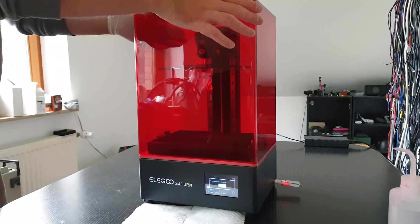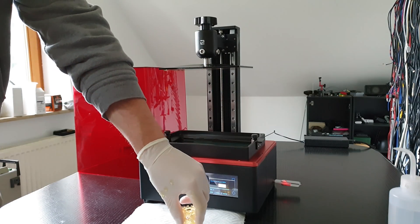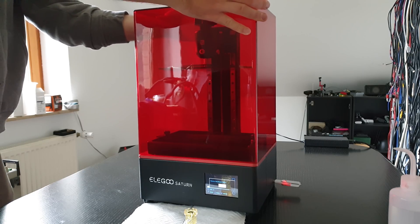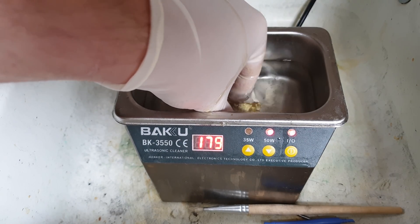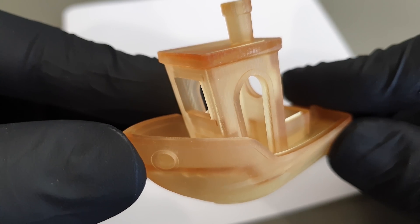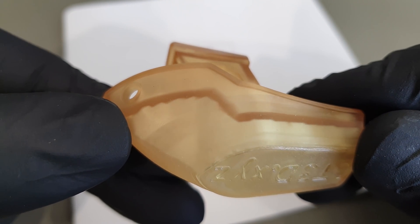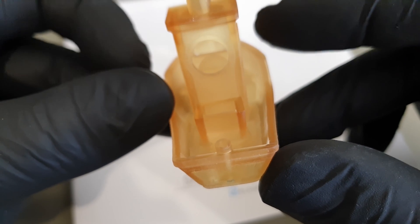Let's see what the new printer has been up to. As always, the resin printing process depends on many parameters being correct, and a change in hardware, resin, or even model can require adjustments everywhere. Since I only just received the new 4K model three days before the release date of this video, I don't think I've dialed in my process perfectly yet. But I can already say that the results on small parts are above and beyond. What benefits the most from the high resolution are round natural shapes — they end up with an almost ground-glassware kind of look. Flat geometric shapes like walls are the only places where pixels are visible to the naked eye, but there is an anti-aliasing function in the slicer to hide those lines if unwanted.